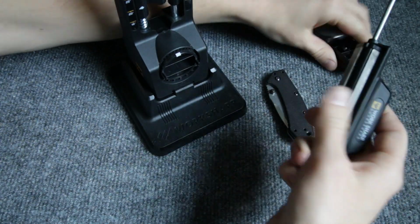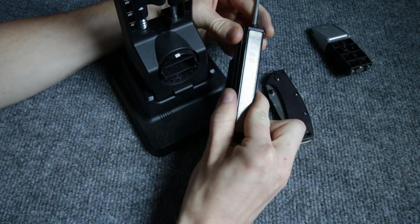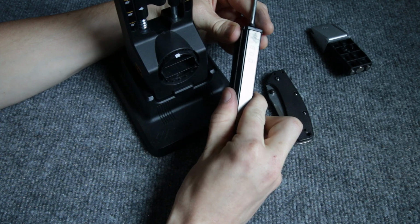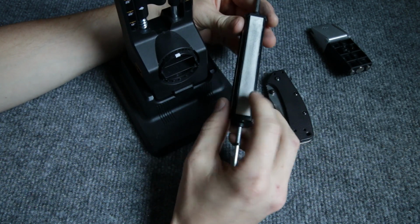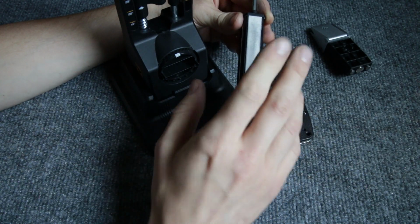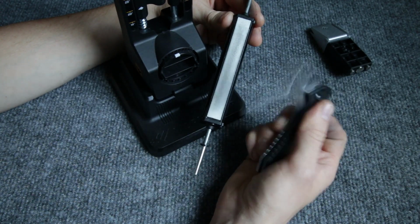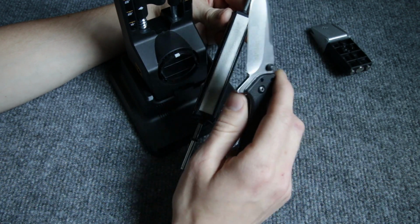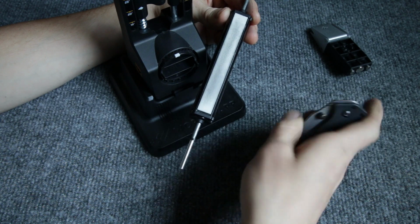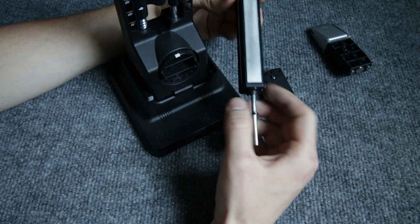There is something we can do to get more grits out of this system than what we have available here, because we only have 3 grits available, 320, 600, and that ceramic stone. But we can increase the grits on this thing, and we can make this thing even sharper, and we can even put lapping pads on here and really lap this blade. So that's going to be for the next video. I'll go into details when we get to that point.